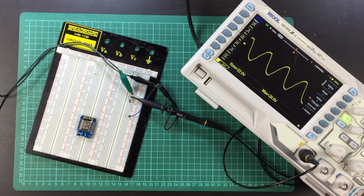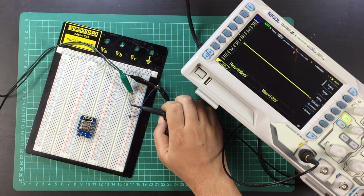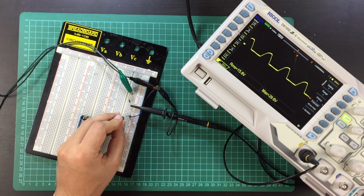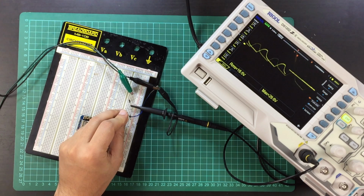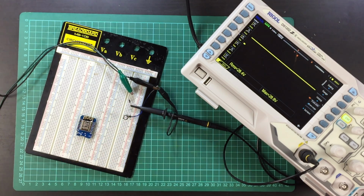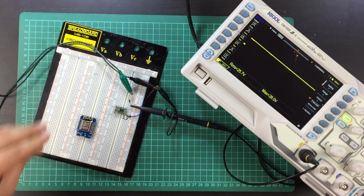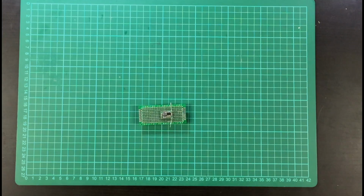Most doorbells are powered by a 21 volt AC current. To get a DC current, I first passed it through a diode, then added a 680 microfarad capacitor to smooth the output. The last step was to add a buck converter to drop the voltage down to 5 volts.